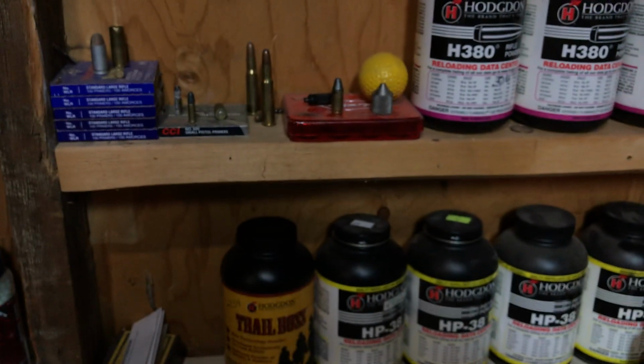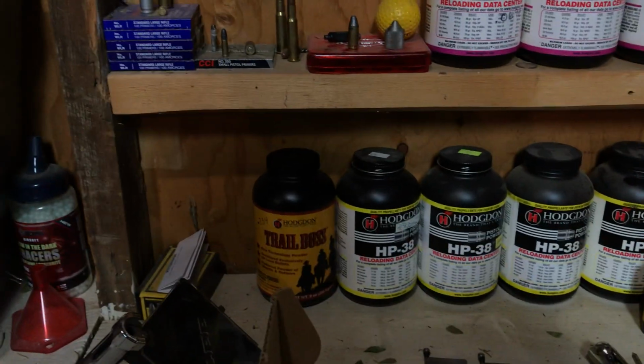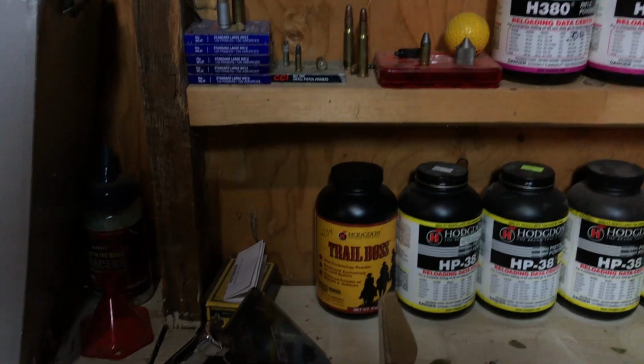Makes priming the shells a lot easier by hand. On a press system that primes for you, it's a little different situation. You've got more leverage with the press arm. So if I'm doing them by hand, I prefer to clean the primer pocket prior to doing it.